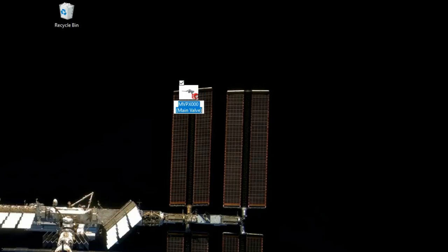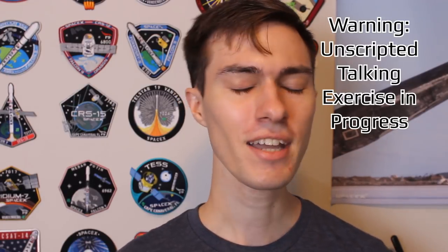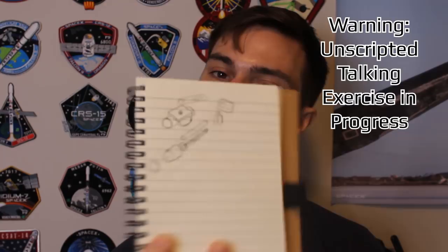And step three: delete everything. So I tried, and this design just doesn't work — not even a little bit. It was too complicated, it had too many parts, it was too heavy, too expensive, too large — it was just not working on so many fronts. I worked on it over two or three days and tried several different iterations using different combinations of motors and gears and valves, but I just had to step back, delete everything, sleep on it for a night. And I woke up and the first thing I started with was, instead of a CAD file, I started with a drawing. The one I ended up using was this one right here — an idea for using still a ball screw, but now in a parallel direction to the motor. This really compactified the valve actuator and also helped me mount everything securely, which was a big problem I was having developing enough stiffness in the other design.